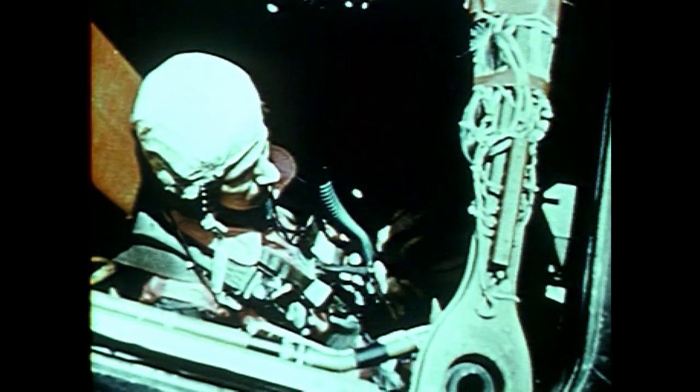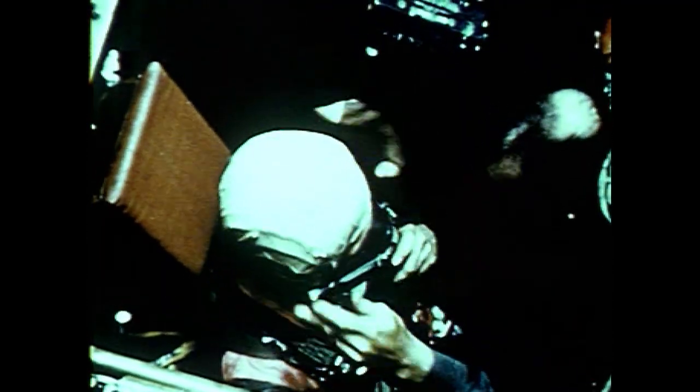The continuous wear anti-exposure suit was tested during this series. A new lightweight semi-rigid helmet, the MA-1, and the A-13A oxygen mask were worn. The jumper carefully assembled his oxygen equipment in the manner proved most safe. To transmit pull to the parachute — not the mask — the nylon strap at the end of the mask is wrapped around the chest strap of the parachute. The modified seat was the focus of attention. The leg guard system had been modified by lengthening the shafts leading to the discs which hold the knees in place, and the locking pins were reinforced. In succeeding tests, the leg guard system proved reliable.